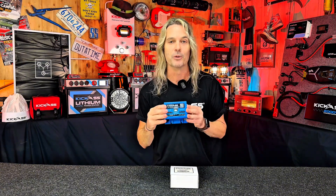You can also override the system altogether. For example, you may have some important medication in your fridge — you know your battery's drained to 11 volts, but you need to keep something on for an emergency. You can override it, though it may still ruin your battery. It will not kick back in until the battery voltage has raised back up to 13 volts, and then it will turn on automatically.